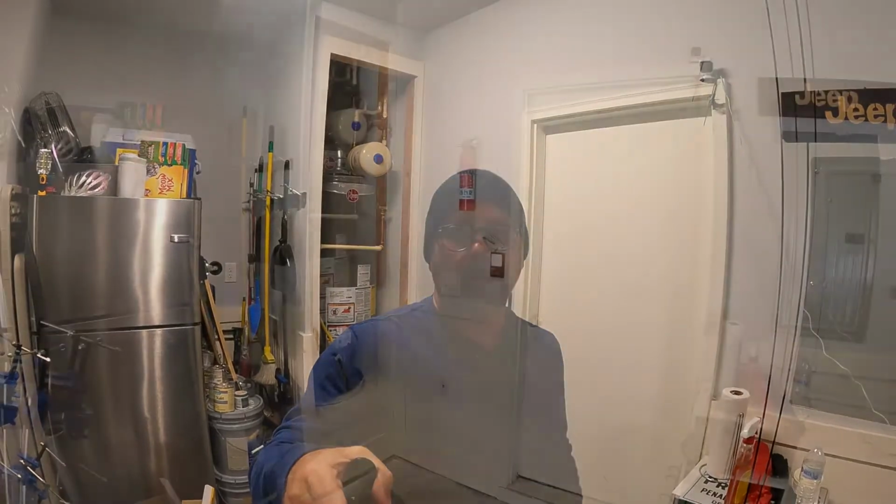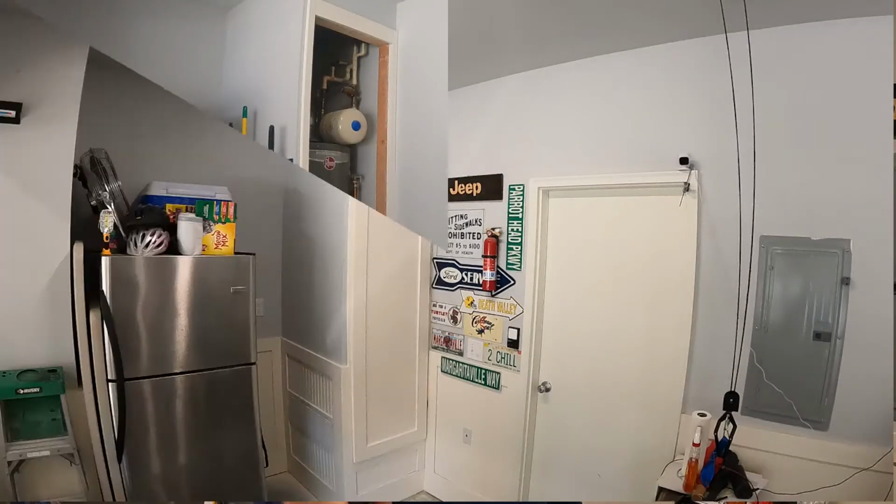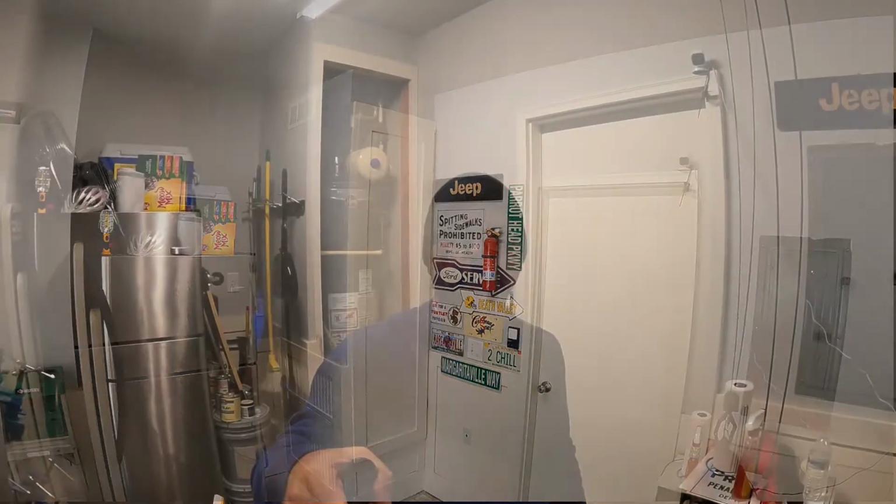Today we're going to build a door in front of this water heater closet. Shaker style cabinet door out of 1x4s, 1/4-inch plywood, a little bit of glue and some pocket hole screws. Very simple, very effective. Probably not fine furniture quality, but good enough for shop furniture doors.